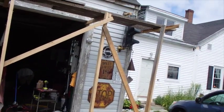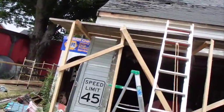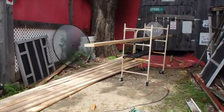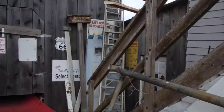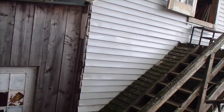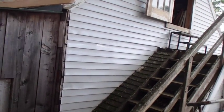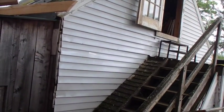I'll bring you up to speed as to where I'm at right now. My scaffolding on the front is done and I'm starting on the back. I've cut two rafters and I'm going to put one on each edge, then pull a tape measure across and check them for squareness. You can't bend the metal roofing and it comes in squares, so if your roof is out of whack it won't fit.